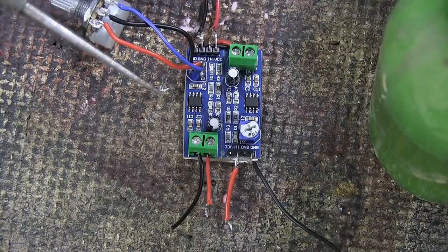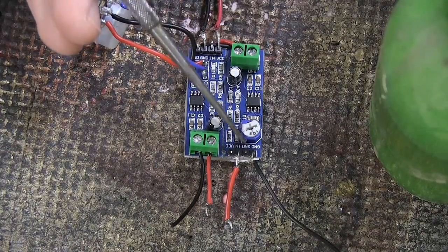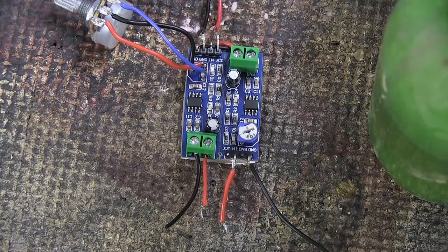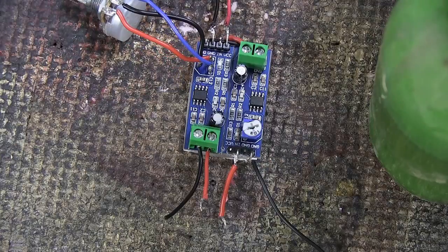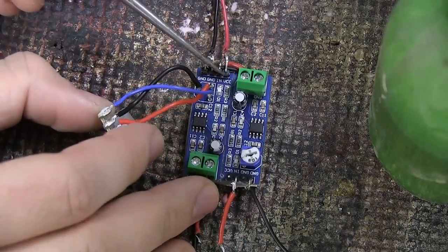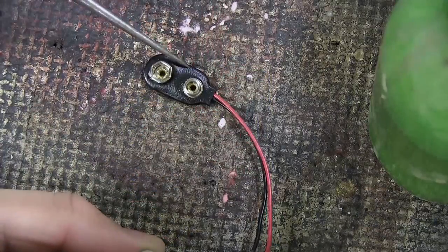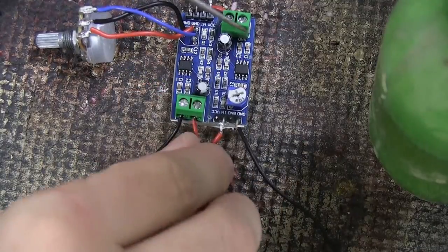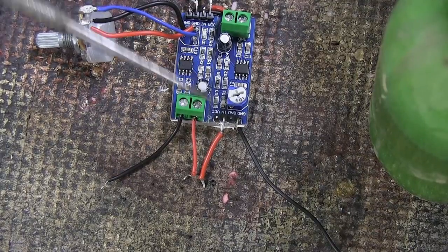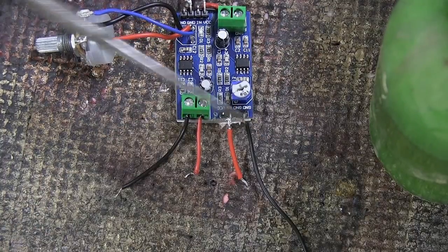Here is the input signal side. What I've done is cut away the two pins labeled ground and VCC because I don't need those exposed pins — on the underside I have all the connections I need. Jumper cables go from underneath up to the VCC pin, and the grounds are connected the same way. On this side I've connected my battery. I've also flipped the two boards around so the signal comes back out — you'll see why when we get to the enclosure. The output and its ground are all neatly together on one side.